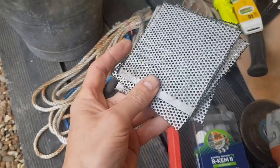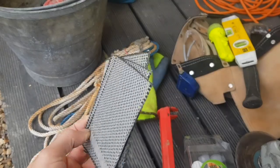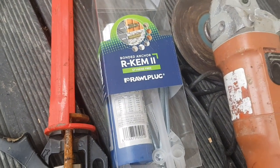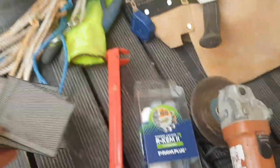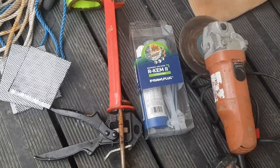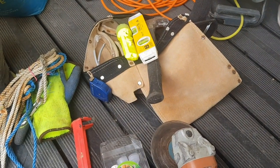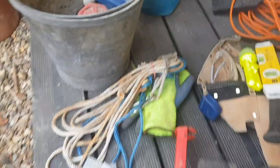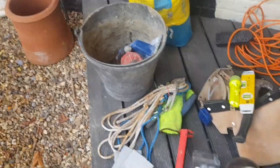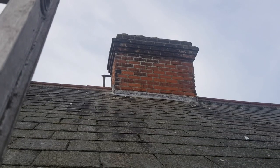I've got these bits of mesh which I need to cover the three other holes where the concrete has degraded over time. I'm going to stick these on with this Rawchem two-pack glue, and then at a later date I can come back and haunch up concrete on top of them to fill them right in. Also just a torch to have a look down the chimney and double-check it's completely clear. I've already rodded to the top so I know it's roughly eight metres.